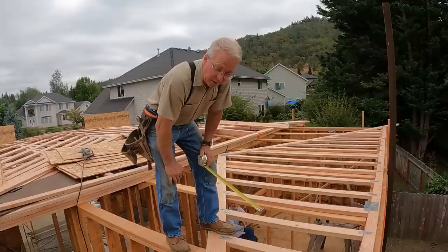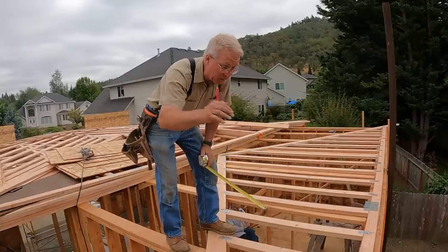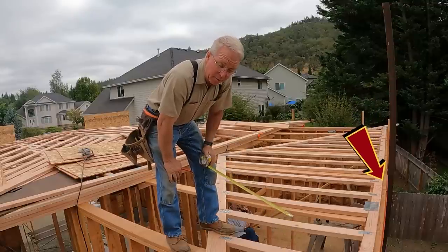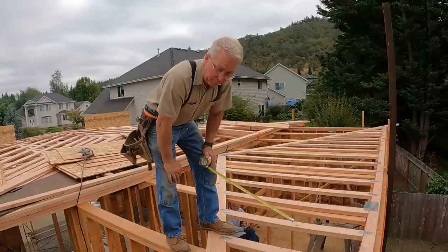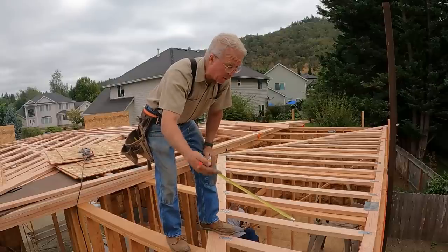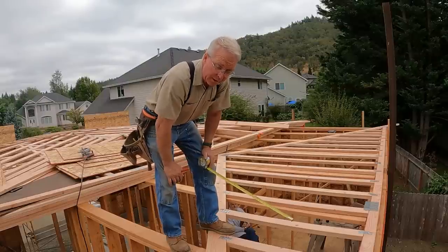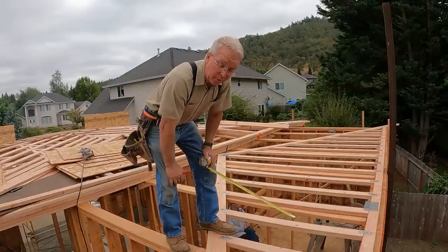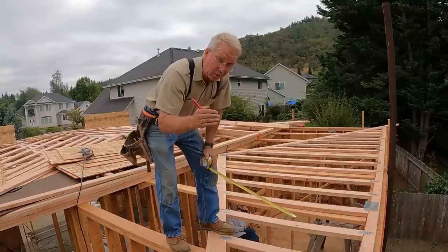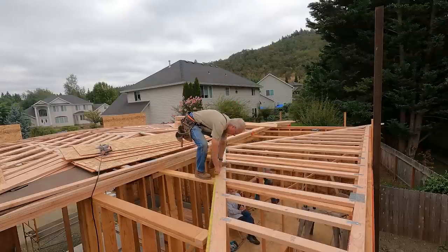We're going to be notching the top of this gable end truss, which doesn't matter at all because the gable end truss is supported all the way along its length on top of this wall. And besides that, there's still 4 inches left uncut, which would have been enough as a top chord on this truss, except we wanted the 2x6 just for the appearance. So cutting an inch and a half out of the top of a 2x6 rafter in a truss is utterly insignificant and is the only way to make the lookout cantilever out over the edge of the building to support the barge rafter.